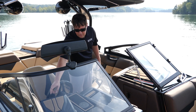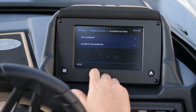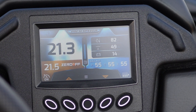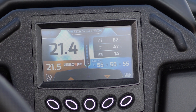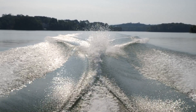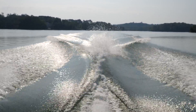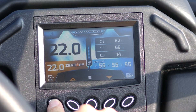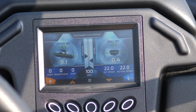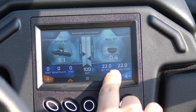After you have done that, go back to the home screen. To check that you calibrated roll correctly, get the boat up to wakeboard speed and run the wake plate all the way up. Get the wakeboard wakes looking perfectly symmetrical on both sides — basically a good looking wakeboard wake. Your roll should be very close to zero degrees. If not, while still at wakeboard speed and having a good looking wakeboard wake, go into settings and reset roll only to zero.